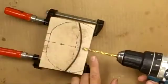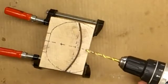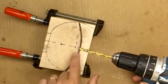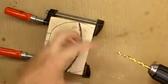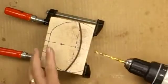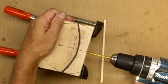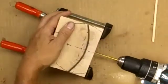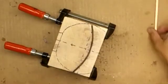You come in here and I'm going to cut through and just stop about right there. If I'm lined up and it finds the bottom hole and it goes in, great. If I'm not, it's going to just nick the top. And that's fine. And then when I put the dowels in, everything will line up properly. But if I'm a little bit not lined up right now, then it might just slip a little. So we're just going to go really light and slow. Just like that. That was a high speed and it went through real easily. And they actually found the hole below them really nicely.